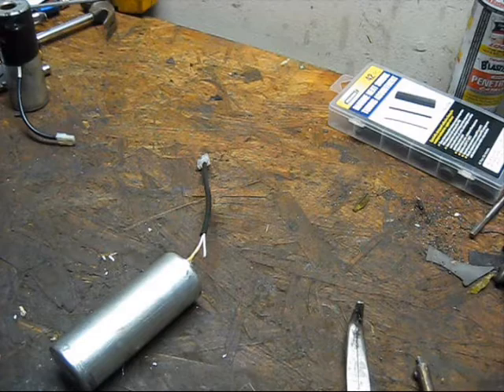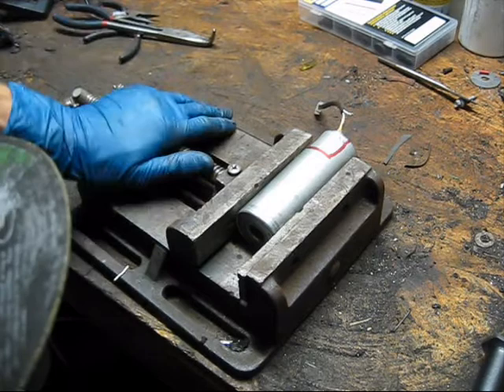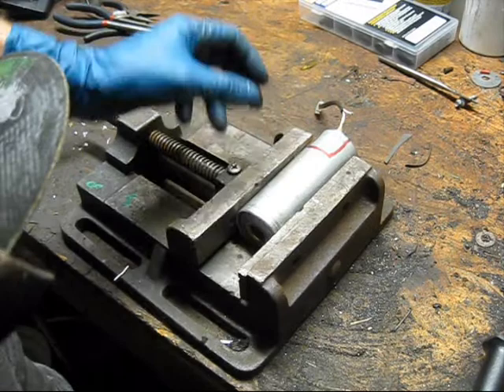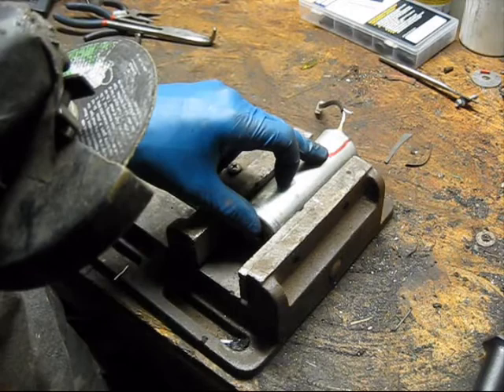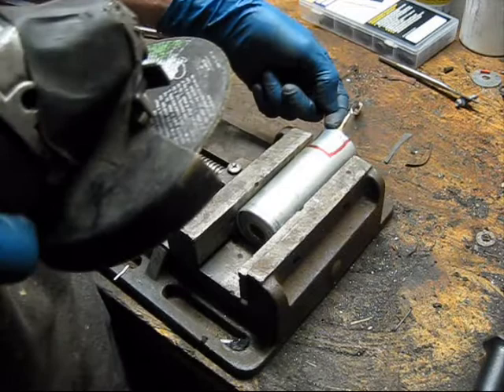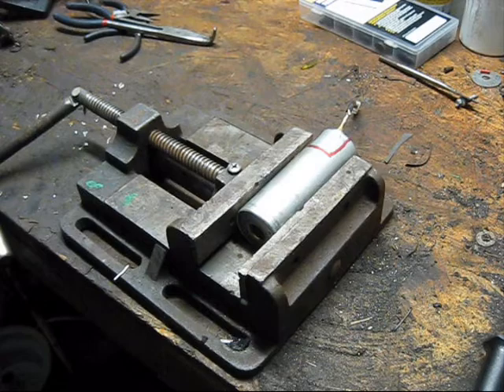Which means we've got to get a little more destructive. To get that apart we're going to use one of these. Moved over to the section of the workbench with the vise, which is somehow even messier than the other section. You can see the basic plan — I'm going to lightly cut along these lines. I've got to be very careful that I don't go too deep, because if I do I'll start cutting into the coils and the entire coil unit is ruined. I'll just lightly cut enough to get through the case, then drive a punch or wedge to get it bending outward, grab it with pliers, work it until it breaks off — that will give me access to the wires inside.